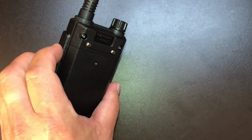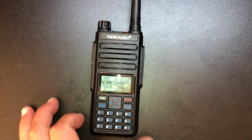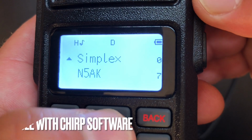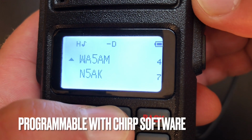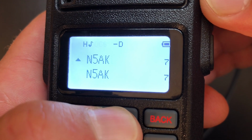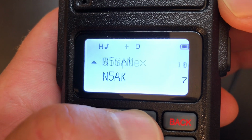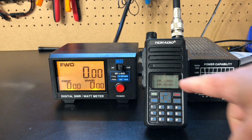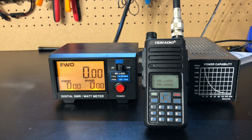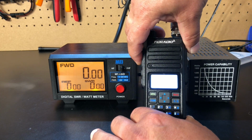So let's program this up, and then we'll throw it on the power meter and see if we can actually get the advertised 10 watts out of it. And now we can see we've got all our channels programmed in here. Very, very easy. And again, really nice screen on this. I really like this. It's nice and bright. All right, so now the moment we've all been waiting for. Will this actually do 10 watts? Well, let's find out. We're on 146.52 and on low power, if you see the little L there. Go ahead and key up, see what we get.